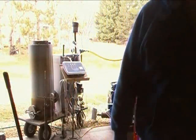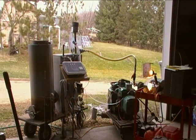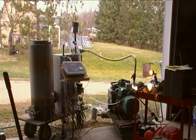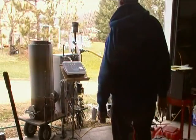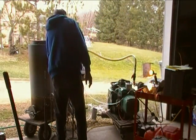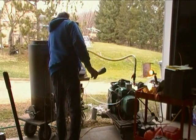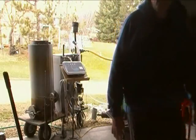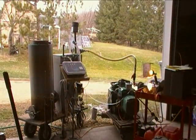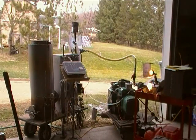The temperature at the bottom of the gasifier right now is 327 degrees — that's about 6 or 8 inches above the bottom. I'm using a garden hose to supply cooling water to the left-hand tank, and that's now running at about 107 degrees, coming in at around 49 degrees when I first started this morning.